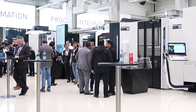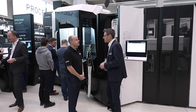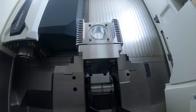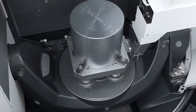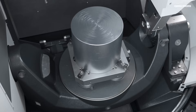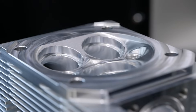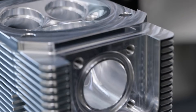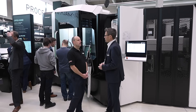What is the PH Cell 500 and what are the differences from what you started with? As I said, we started with the 300, so that automation solution has a clamping system on the table. This new development has an integrated clamping system, so you have more working space, more rigidity, and more kilogram capacity on the pallet. As the name suggests, it's 500 kilograms on the system.